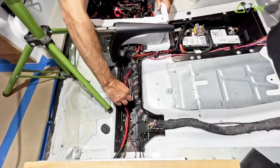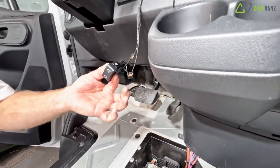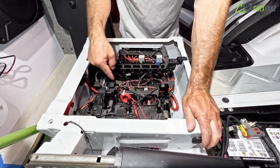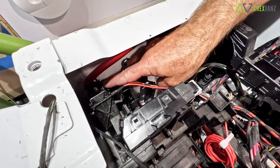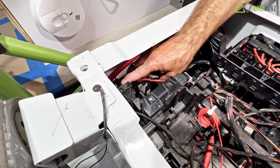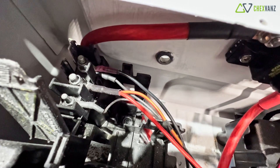So what we've done is taken this 18-gauge remote start wire and it splits off. One of the wires that comes from your DC-to-DC charger runs through this complex underneath the dash and pops into a factory Mercedes auxiliary switch. The other cable runs back through the dash, comes back through here into this battery complex, and connects into the back right location. There are three different locations here you can use. The reason we selected this third location — and this is important — is that this third location only receives power when your engine is running. Whereas the second location, for example, will receive power even if your van is turned on but the engine is not running, and that's not what you want. You don't want your DC-to-DC charger running without the engine running. So we selected that third location.